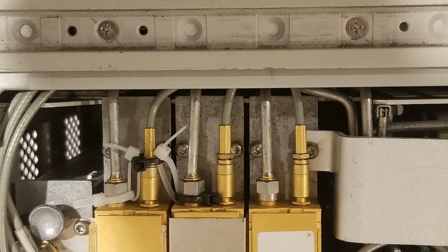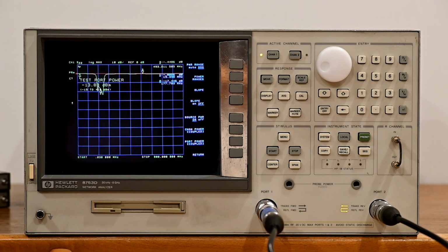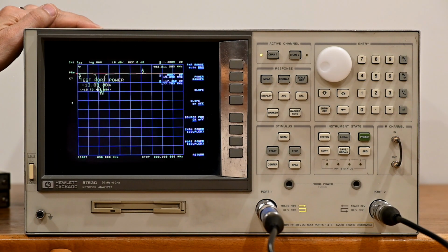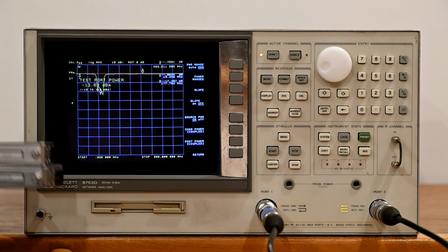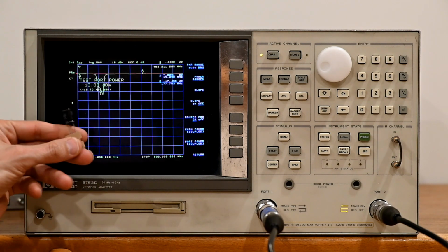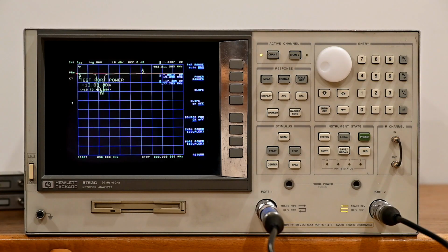As you've seen from the results here, the filter measurement, beautiful. It curves and everything, so no issues there. But there is a physical problem on that port coupler. So some minor cosmetic issues here and here. And then the issue with the sampler and possibly this, but I'm not able to reproduce that issue at this point. And then of course the capacitor issue on the power supply if you want it to not blink during the calibration. That's it. Thank you for your time.